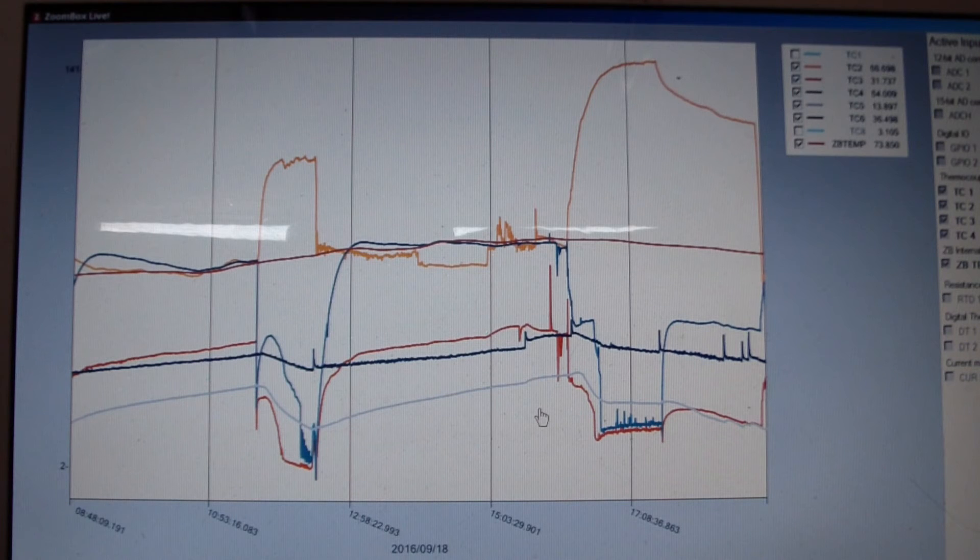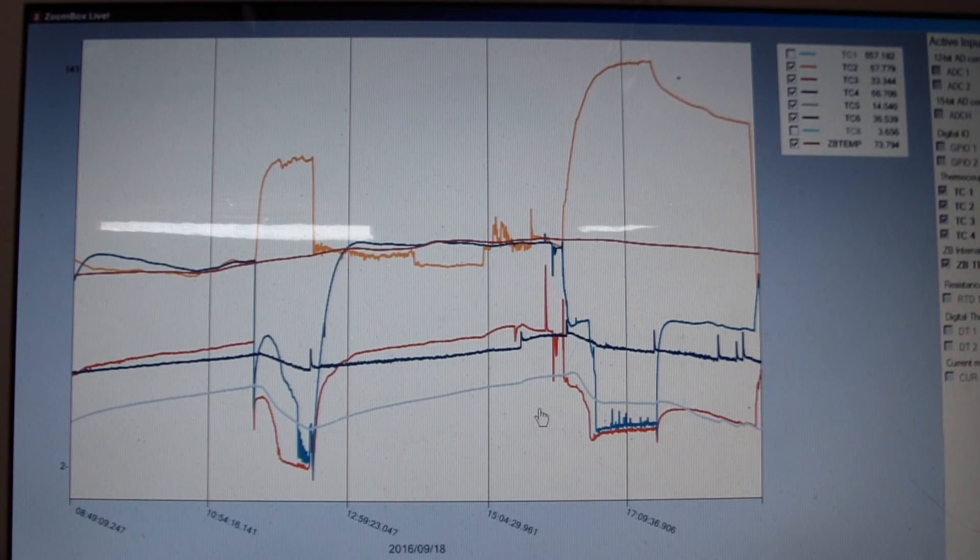After the initial temperature drop and the plateau following the overcharge, once I vented the refrigerant we can see a slow decline again. I was running higher superheats than I'd like. To make this system run more efficiently, I'd need to change the capillary tube, and before that I'd look into adding a subcooling coil after the paraffin tank. I'm not sure I'll pursue this much further, but I spent a pile on vaseline and can't return it. This is my first thermosyphon that actually works and has a purpose.